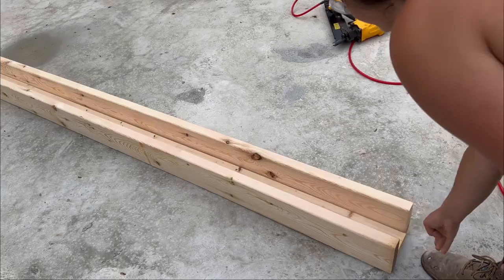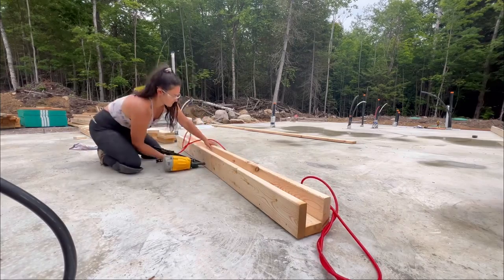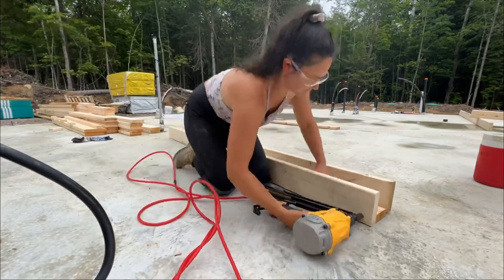Time to build the wall partitions and the header for the next wall. The reason I'm building these wall partitions is because an interior wall is going right up against where that two-by-four is. When I first started I wondered why you need all this extra wood, but when you go to put the drywall in you need a place to screw it in — that's why you need two-by-six, two-by-four, two-by-six. All our exterior walls are two-by-sixes because we live in Canada and it's better for insulation and snow loads. Most interior walls are two-by-fours except load-bearing walls, which are also two-by-sixes.